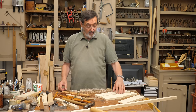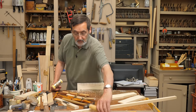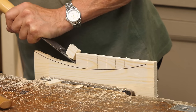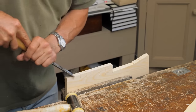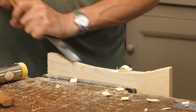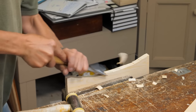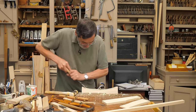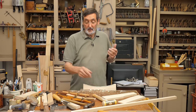What I want to do is give you some idea of what you can do with them. I'm just going to get this down to a place where I can use one of the spokeshaves and show you how effective they are. I'm creating an arch on a piece of furniture — I may have cut this on a band saw — but you ultimately come to a point where the finish is not good enough. Do you sand it? Do you spokeshave it?